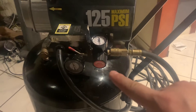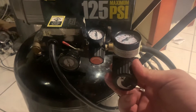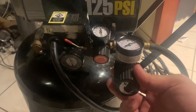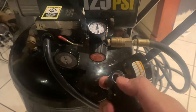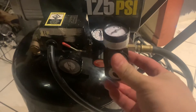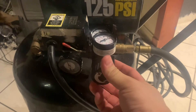If your new air compressor regulator does not work, it is most likely because of one thing: it is in the wrong orientation. This side — this threaded hole — if you look down you can see a spring where my thumb is. That is the correct orientation; the internals are open, so to speak, and you will just thread it on in this orientation.